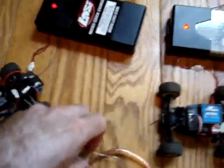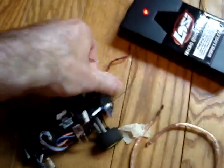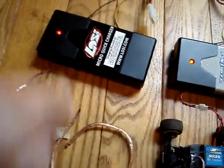We had to do that for both cars. Take that other end, put it on the positive lead, take it to your paper clip, and just touch that to this positive lead right here for just half a second. As soon as the LED pops on, just take it off. That's like jump-starting the car from a dead battery.